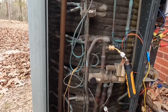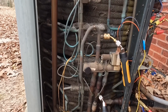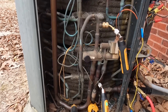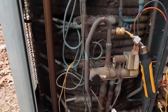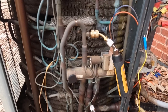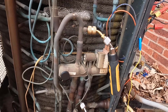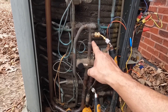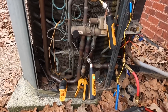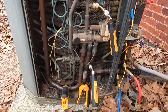It's off — the pressures are slowly equalizing. I'm not 100% certain about that, but my money's on this right now. Inside here, there's nothing but a compressor and a muffler. It's not passing pressure from here to here fully like it should — that's just a short distance. When it's running in heat, I'm not getting all my pressure through.